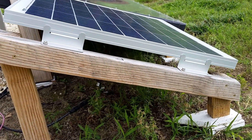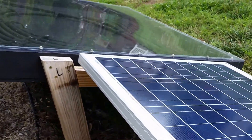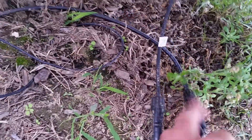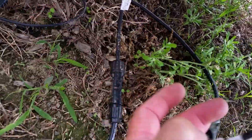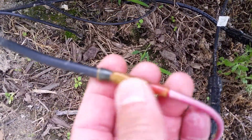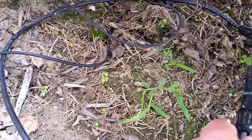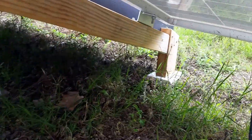That's how it's built. When the sun shines it operates the solar panel which runs my bilge pump. My disconnects are right here - these are MC4 connectors. You got your negative right here, and here's your positive connection right here. Red is your positive, and everything I used is number 10 wire. These are 3M marine heat shrinks before they hit my MC4 connector - this way you can disconnect the panel. You can see where it's hooked up underneath there.